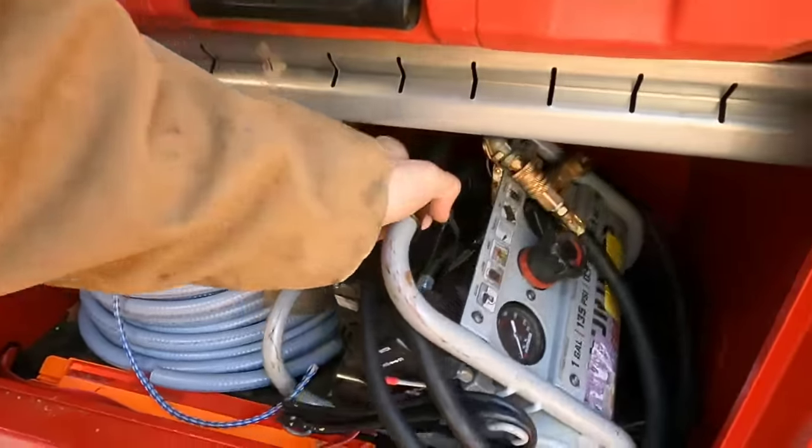We're gonna air the tank back up and see if, while we add air to the tank, it makes the water get dirty, because that's what it should do. If a tank's bad and the tank is the reason they're getting discolored water, when you air it back up, you're filling it back full of air again, and you're forcing all the trapped dirty water out. So that's what I expect to find